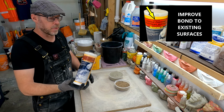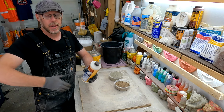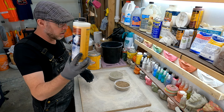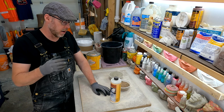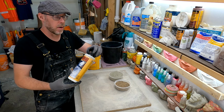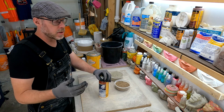So this is an acrylic fortifier. Don't worry about the brand, Quikrete. If you don't have this, there will be something available to you in your area. Go in the concrete aisle. Look for something that's a thin, white, milky liquid, and that's the stuff, acrylic or latex fortifier. And you can add this to a concrete mix in varying proportions depending on the results you're trying to get.